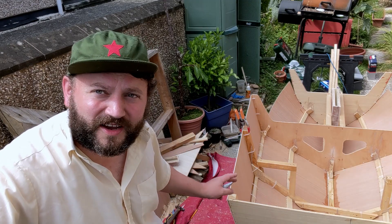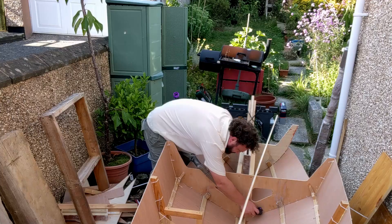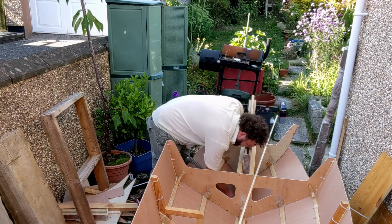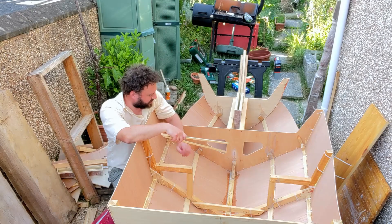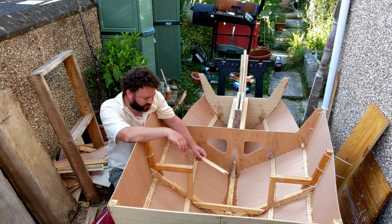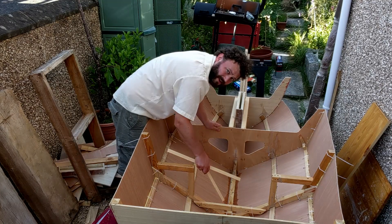This is the port side freeboard panel which is now gluing up after it's been zip tied into place. I've filled in a little bit of filler at the bottom there, and some of it was seeping through so I've strengthened the tape at the bottom — using some better tape, hopefully a bit more epoxy-proof. I've also cut out these batons which are hopefully going to stiffen the bottom of the boat.